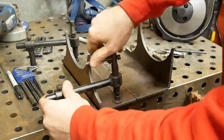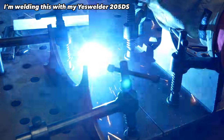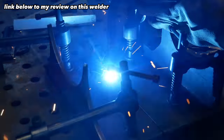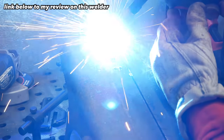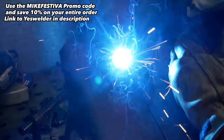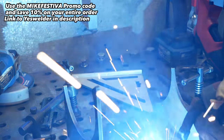If you're newer to welding, I could not stress enough how important it is to clamp your metal down to keep it from warping and not work over one area too much with heat. Try to move around a little bit to dissipate the heat and let your parts cool off. I have a nice welding table I can put clamps in, but if you didn't have something like this, some C-clamps and some heavy duty angle iron across your two plates would be pretty adequate. Just try not to put too much heat into your work piece or you will definitely get some warping.